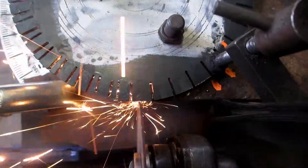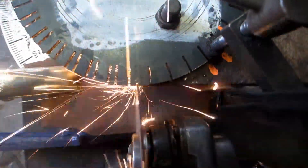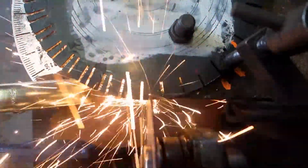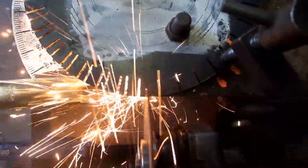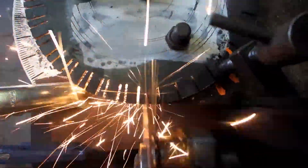The one-millimeter cutting disc wandered because it's too flexible, so after I drilled the teeth out I had to put the disc back in and skim both sides of the tooth with a big six-millimeter thick grinding wheel to make it more accurate. You'll hear it now straining as it's wandering and jamming.